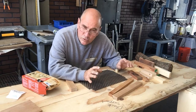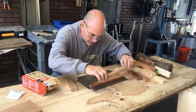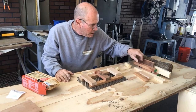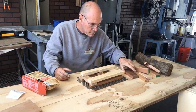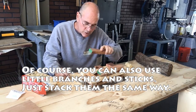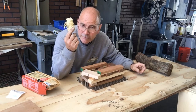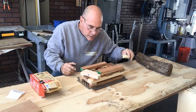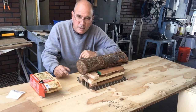The proper way to build a fire inside a wood stove is to build yourself a little log cabin. I'm doing it out here so you can see how it's done. I've got some pieces here that are going to fit inside the stove, and I'm making myself a nice little structure out of wood — a piece of mahogany right there, expensive piece of wood, and cherry. Spare no expense. These little guys right here are nice to have — these are fire starters. You can get these at the grocery store or any place where they sell firewood. I'm going to put one of these in there because that's going to help the thing get started. Then on top of my little log cabin, I'm going to place the big stuff.